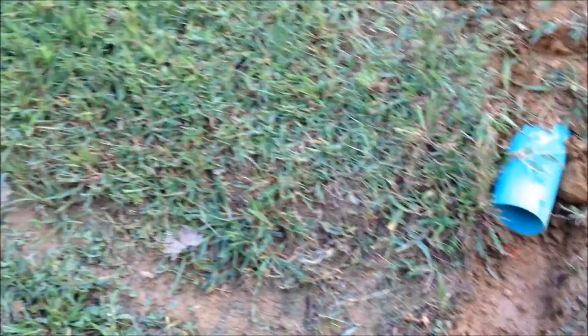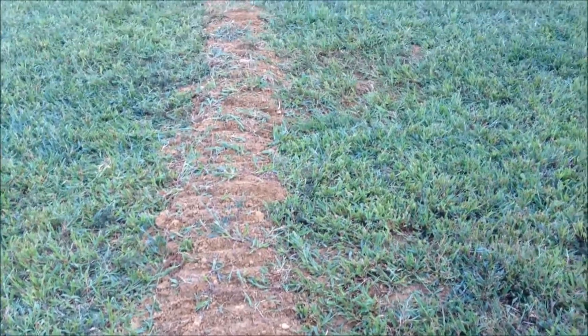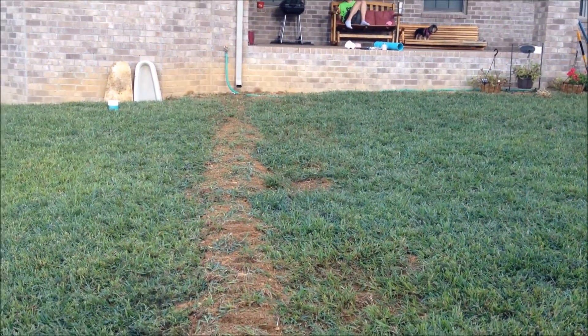There's where it's gonna dump into the ditch for the time being, and eventually there'll be a pipe there. And there's the trench that I filled all the way up the yard. What's up now is I've got to remove the gutter ends, the elbows, and once they're removed tonight when we run out I'll pick up a couple of extension pipes so that I can extend the gutters into the drain pipe. All that's left right now before I call it quits is I need to get the adapters — the gutter adapters — glued into the elbows, and that's pretty well it.